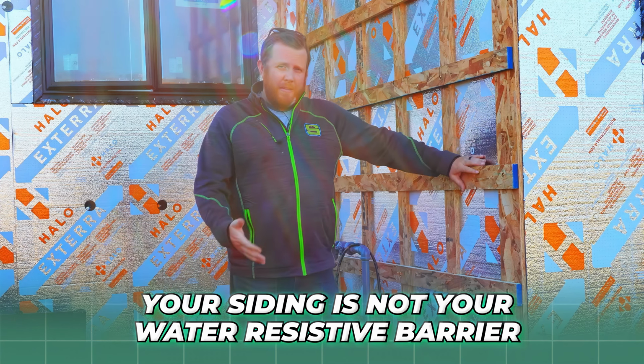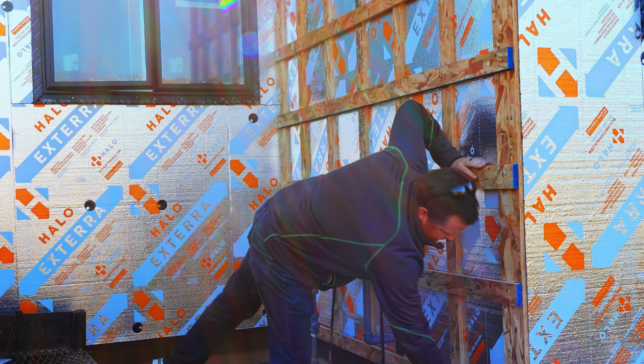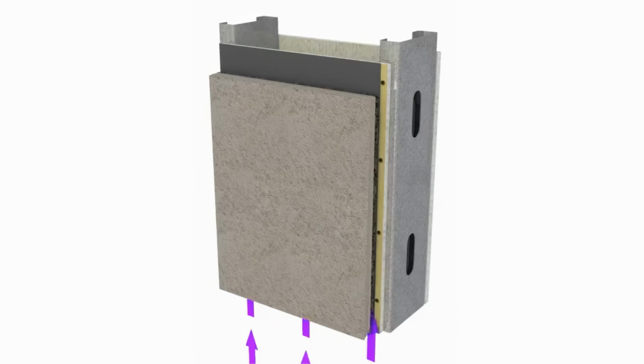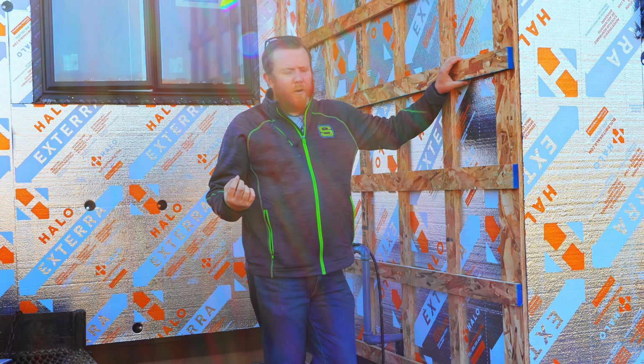So by putting a rain screen on, we're creating this chamber that, what you can't see is there's a little gap down on the bottom that air will be able to come in, go up, and it loops out. So we're creating this convection cycle, our flow cycle of air, that when any water does condense, it dries that out immediately in the process.